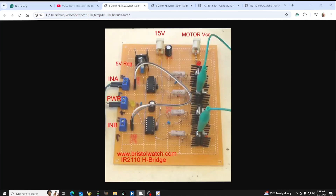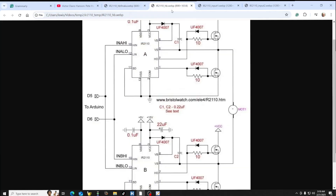Here is my original H-bridge circuit board. You'll notice I have a set of jumpers from input A — this integrated circuit — and input B. They're jumpered and cross-wired, which is what you see in the schematic. High-N of integrated circuit A goes to Low-N of circuit B, and High-N of B goes to Low-N of A. Remove these jumpers — they need to be removed — and we're going to replace them.